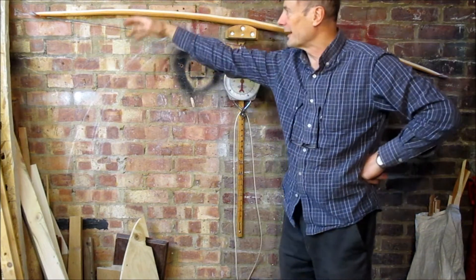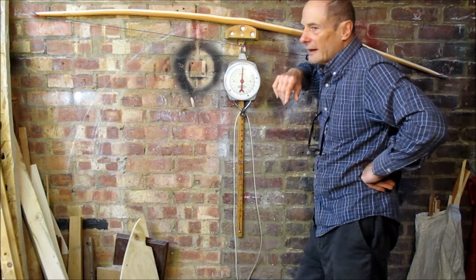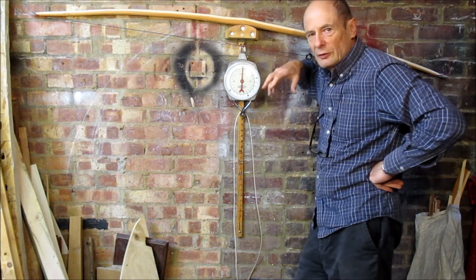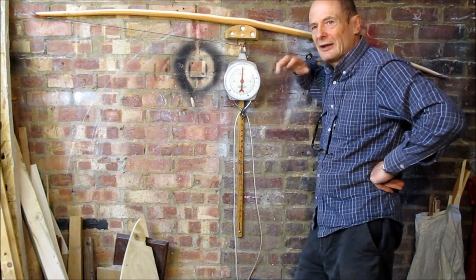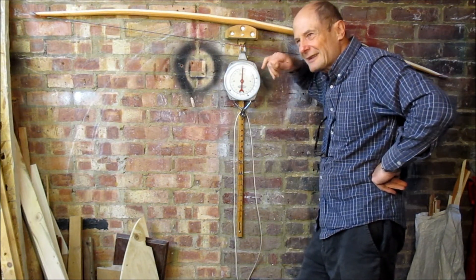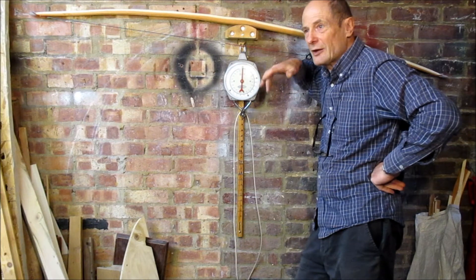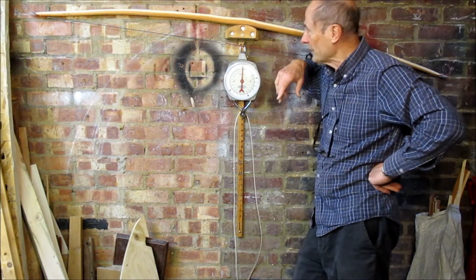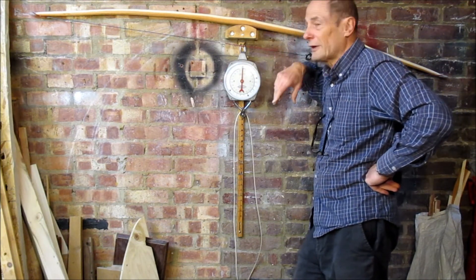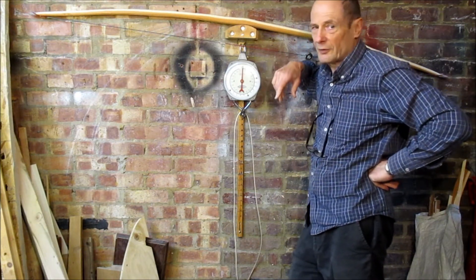I've taken quite a lot off the belly, especially the outers, trying to get it coming round a bit more. We're still nowhere near there — I think we're probably about 125 ish. I just want to have another good review, the tiller's looking better, so I know where to start taking some more off. I don't want to start fiddling; I want to give it a good decent rasping along the belly, else you end up moving so slowly you never get there. But conversely I don't want to take a load of wood off in the wrong place.